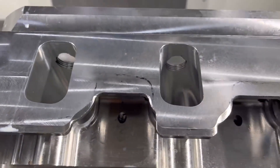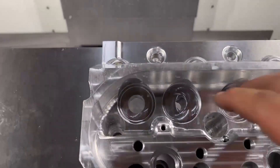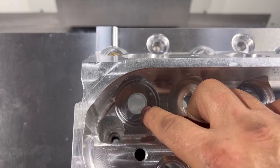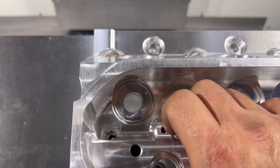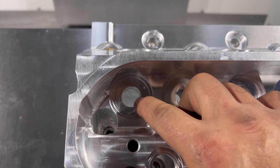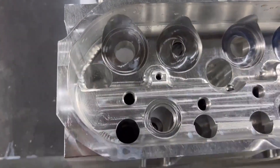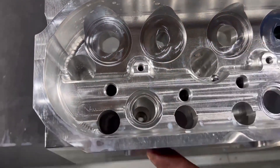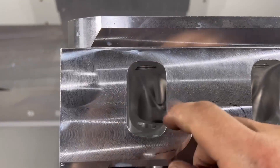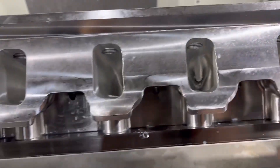The ports are all done. You can see all the ports now. Notice the extremely large hole for a guide — I'm using the same guide program I use for the SMXs, which works best for the driving portion in drag race: extreme heat and length of time. The intake guide is a standard deal; this is my custom deal. This is the head bolt hole that goes down through, caps through the intake port. You can see the access port hole in the bottom intake ports.